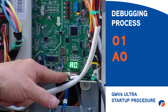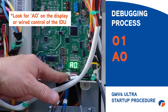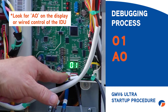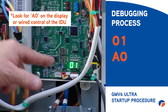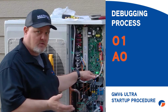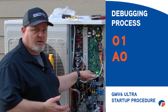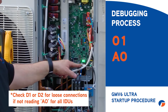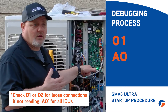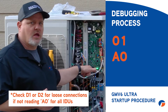Before you put it through debug, go inside first. If it has a display on the wall mount, it'll say AO. If it's a ducted unit or a cassette, it'll say AO on the wired controller. Any machines not showing AO — don't start debug yet. Check that you've got 230 volts to it, because all GMV indoor units are 230-volt powered. Also go back and double-check your D1 and D2 communication wiring for loose connections or missed hookups, because all indoor units should say AO.